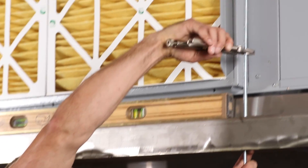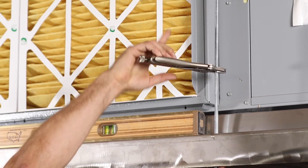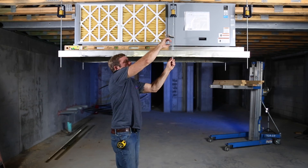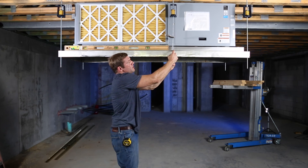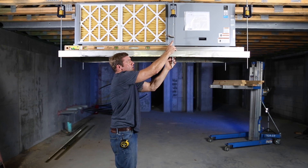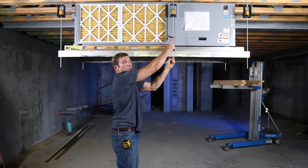Also when we were jacking this unit up with the drill, we put a pair of vice grips on the threaded rod to stop anything from spinning up here at the isolator. When you do this, make sure it's nice and tight so it doesn't slip. You also want to do it some distance away from where you're working, so that if you do end up damaging a thread, you're not actually going to be spinning a nut over that portion of rod.